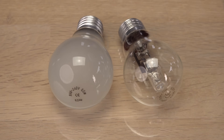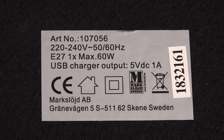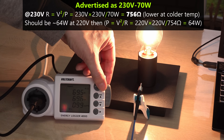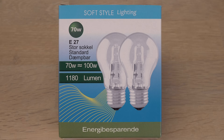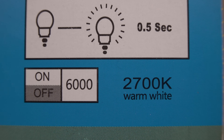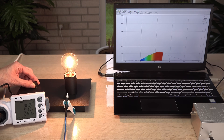How about another incandescent lamp type that is known to run even hotter? A halogen lamp. This 70 watt halogen is a bit over the top for my 60 watt light dimmer, especially since it seems to be more like 75 watts. The marketing department also seems to get the color temperature wrong. Halogens are only more efficient when they, due to the halogen cycle, can run hotter than ordinary incandescent lamps, giving halogens a color temperature of typically 3000 K, not 2700 K.